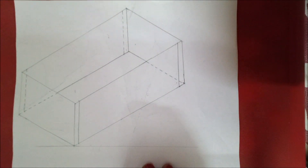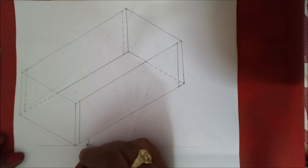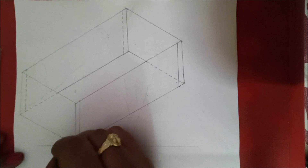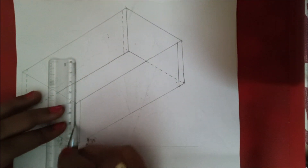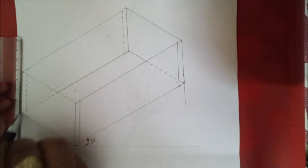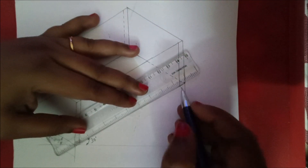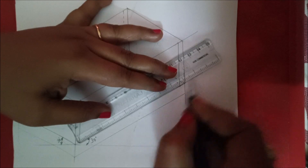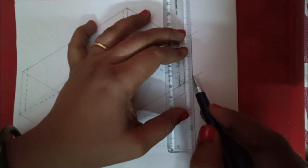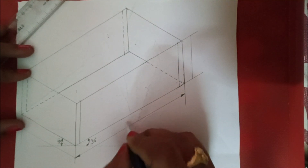This is how we draw the rectangular tray in tinsmithing. Now we are going to give the dimensions — first give the angle as 30 degrees on both sides. For giving the dimensions, first draw extension lines for each and every side. Make the line parallel to this and draw a line here, and similarly for this dimension also draw extension lines. For each and every dimension line, give an arrow mark of size 3:1 ratio, and the value of this length is 120 mm.